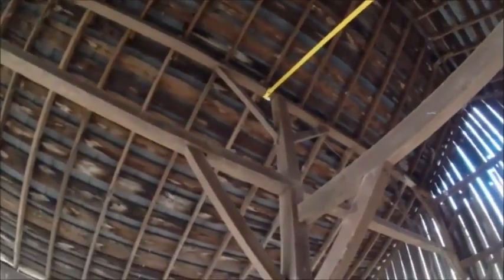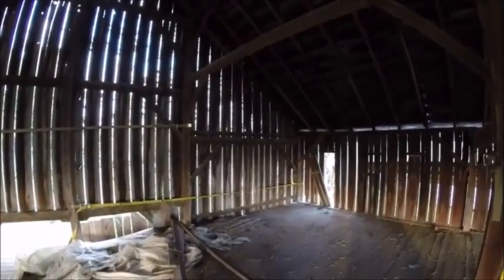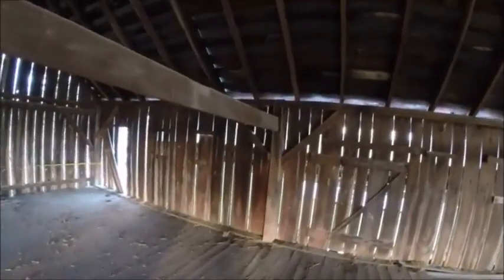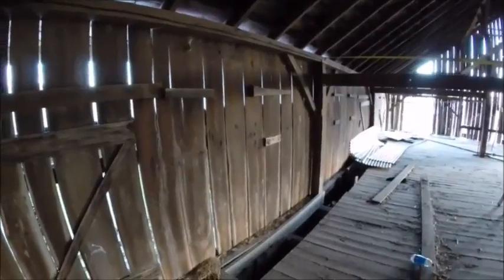we're getting somewhere. So you got that end, it's sitting square but low, so that whole wall still needs to come up. That corner over there needs to come up. That's another deceiving post. Looks good, but it's not. It's trash. This next one behind it here, same thing. It looked pretty good initially. It's powder post beetle trash. Replace it. The rest of them on this side are all good, all the way to the ground. Checked them totally out.